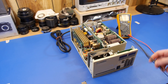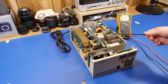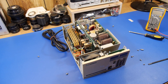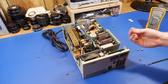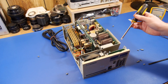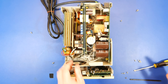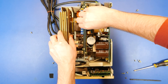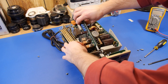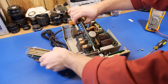I'm going to start the teardown by disassembling it from the sides. This is more of a full-fledged teardown — it's not like I can just get to one component. Everything basically has to be disassembled from this case; it's not a very modular design. With most of the screws removed, I want to note that these are all machine thread — none are self-tapping; they all have threaded inserts into the PCBs or the folded steel pieces. Now that all screws are unfastened, everything comes out like an array of cards. The middle one's a little tricky as you have to slide it up out of a groove, then disconnect a bunch of keyed cables.